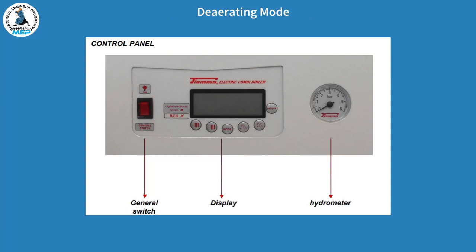If you ever have to drain the boiler on the primary side and fill it back up again, you can put it into a special mode. To do this, you press the mode switch and the on-off button together, and then you'll see 'DE' in the display. This will last for 13 minutes — it's to get the air out of the boiler and go through its functions. Once that's done, it should be ready to go and run quite smoothly. If you want to cancel this DE function for any reason, just press the on-off button once and that will cancel it.